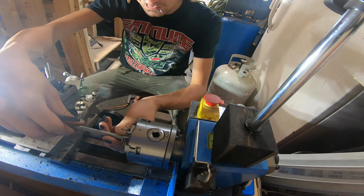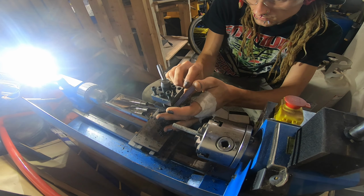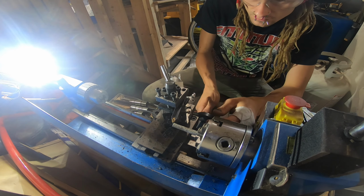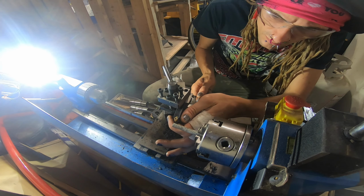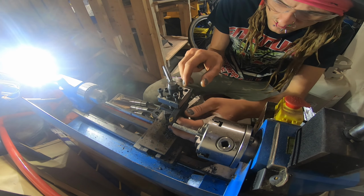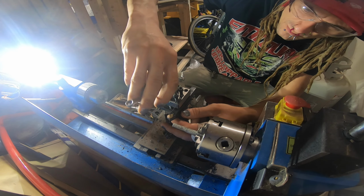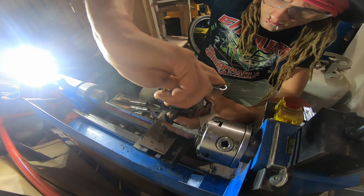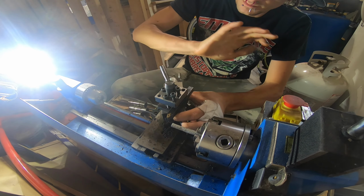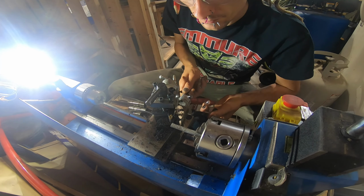Almost lost the camera. Now, as you see, I'm swapping my tooling out here, from one of the littler guys to something a little larger. Putting in some shims there, making sure it's centered on the workpiece. Tightening down the tooling itself. Now a little adjustment to the tool post. Put on a bit of an angle, 25-30 degrees-ish.